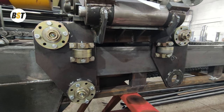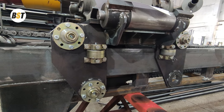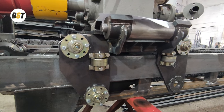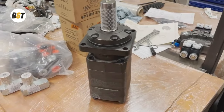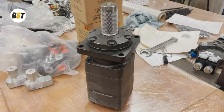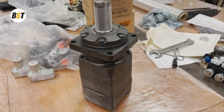The carriage on rollers is highly appreciated especially in conditions of increased vibration. There can also be a folding carriage, whose main feature is to fold to the side in order to facilitate the installation of casing pipes or to allow support operations with the hydraulic winch. The rotary head can be presented by hydraulic motors or equipped with a hydraulic reducer according to your technical assignment.